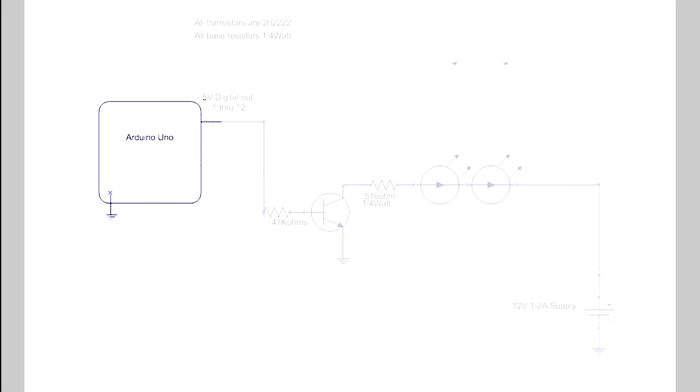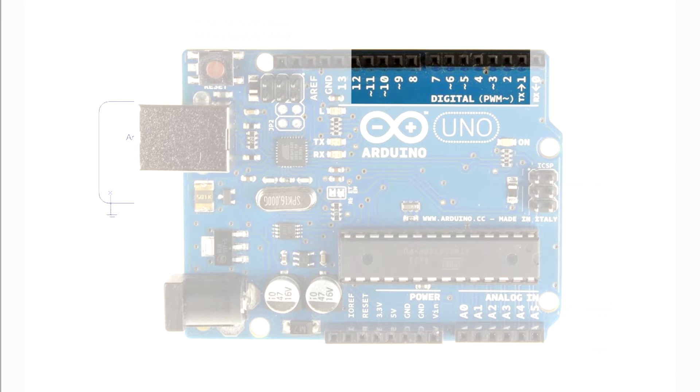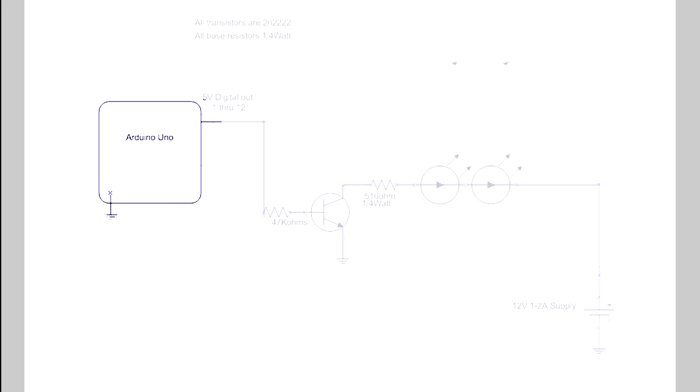To start with, I'm using an Arduino Uno to control the flashing LEDs. I'm not going to make this an Arduino tutorial — there are plenty of tutorials on YouTube for the Arduino already. Using digital pins 1 through 12, I first set them for output in the program. The circuit diagram shows a single Arduino digital output, but just remember there are 11 more outputs for all 12 sets of eyes. They're all the same, so there's no need to show them all.